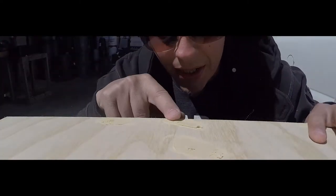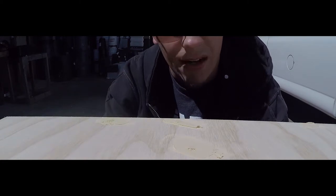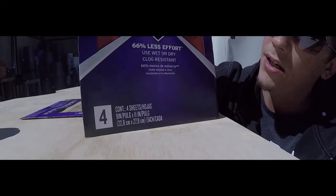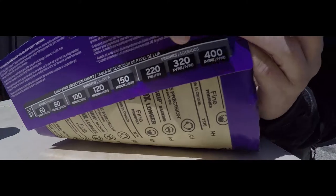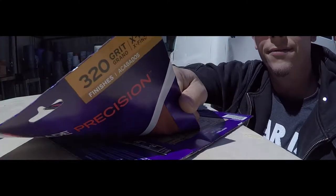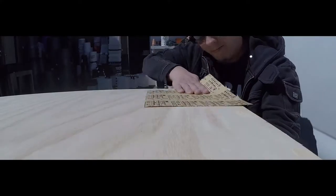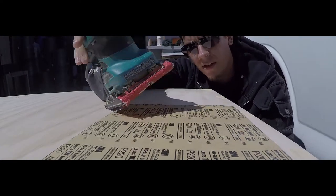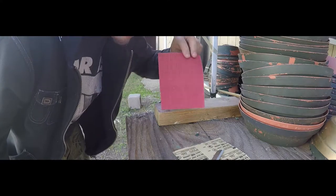As you can see, these holes I filled yesterday - that's where all the screws are. I wanted a nice flat surface, no screws showing, no sign of assembly - like it grew this way in the forest. Here's the thing about sanding: you always go with the grain. Sandpaper is categorized by number - you start from 60 and go all the way up to 400, which is real fine. 220, 320, 400 - 400 is so soft it's like a baby's butt. You could do this by hand or with a machine, cutting it to quarter size to fit exactly.